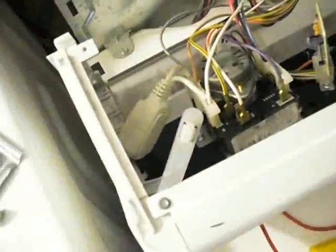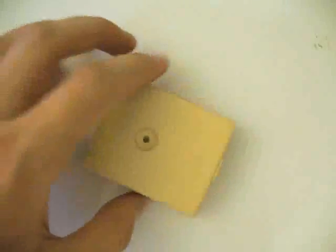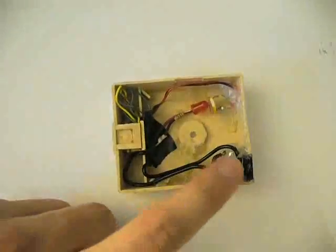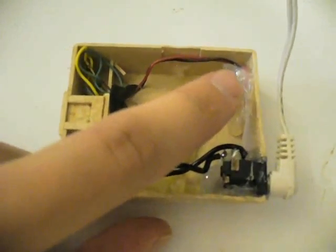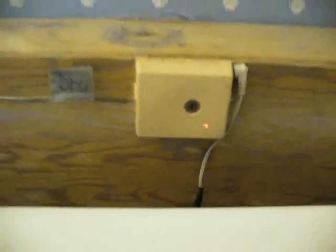Plug that in and run the end of the transformer out of the back of the dryer — that's what we'll power out of the phone jack box. What we have in the box is a connector that connects to the transformer coming from the back of the dryer, then a resistor and our LED, and then a photoresistor that goes to the jack port which leads to the Arduino. Here's the finished product on the bathroom side, with the box mounted there. We turn it on and we get a little LED shining through.